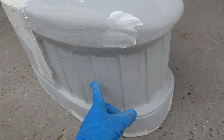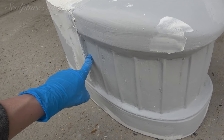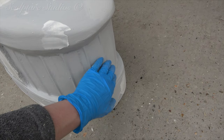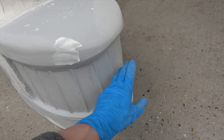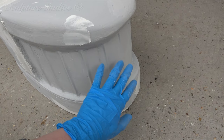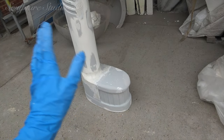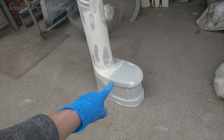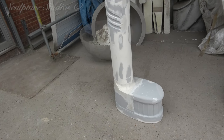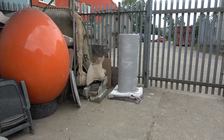We have rounded the details so that should make things slightly easier. It is already a nice flat and we haven't had to compensate for that. We will just have to make sure that it's not poking in a diagonal — we'll have to make sure it's got a slight inward chamfer. Same for this bottom line here, but obviously this one is going to be the tricky part. We may have to split it directly down the middle because these two do act as a bit of a grip. There's a degree of flexibility so it should be fine. If not, it may be a case of taking them out and re-sculpting them in later, or taking a silicone mould of just this area and having that as a separate piece added in later — not a problem. But as with all things, you do need to think very carefully before going ahead and making sure you've got everything covered.